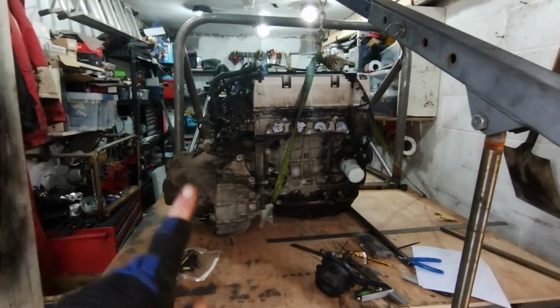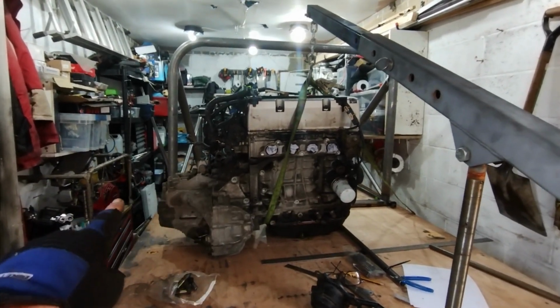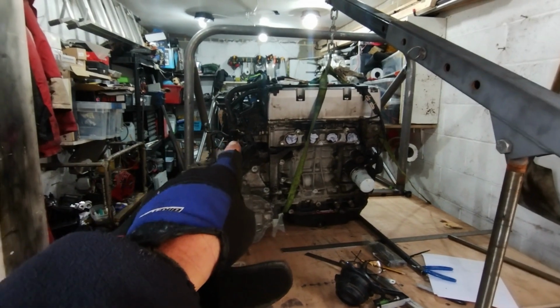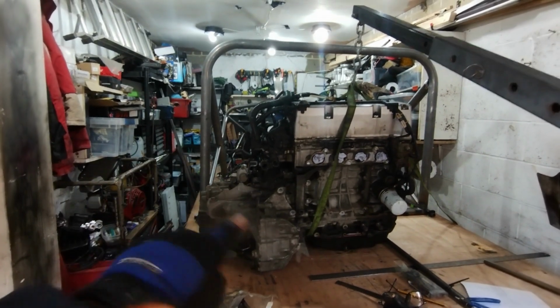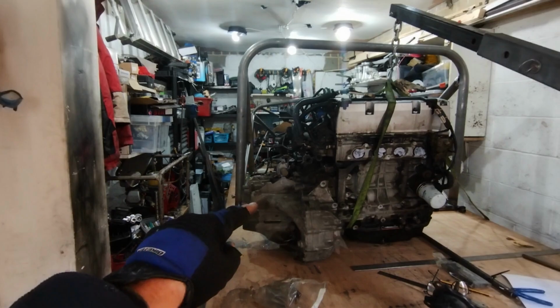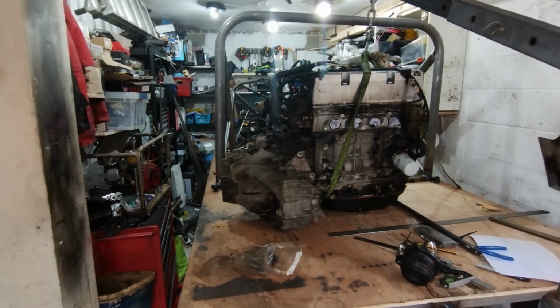Well, bolting that gearbox on certainly answers a few questions, doesn't it? The choice for the upper part of the cradle is either wide at it and low or above it. Well, you see the width, it's just so wide. Obviously the cradle's got to come above. So what I need to make sure with my suspension calculations is I need to have a mount that's above, so it needs to be minimum height to there. But obviously also I need to make sure I have enough clearance so the suspension doesn't foul the gearbox, which would obviously be a fair old cock up.